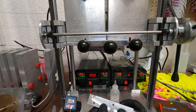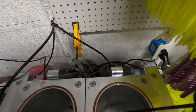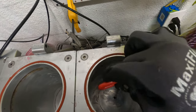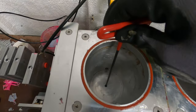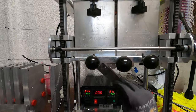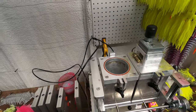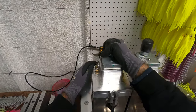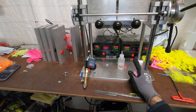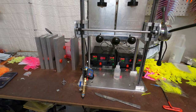The machine comes with a really long allen key. Pull the handles out just like that — that opens up the cavity. Look down in here at the bottom and there's a hole. I just push this through, same thing on both sides, and anything underneath here will come out of the hole just like that. Go ahead and take your block, put it back on, put the stir motor back on both sides. That will allow the temperature of the pot to get up as close as possible to 300 — that's what I always wait for, or at least about 270.